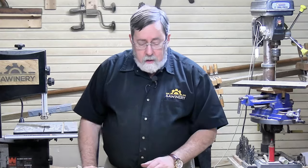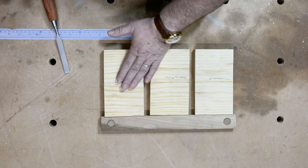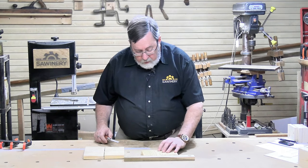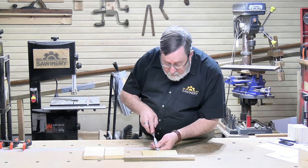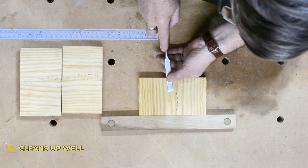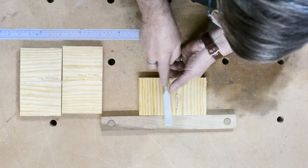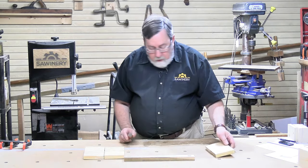The other thing is how easily do they clean up? Looking at the Titebond, it's going to be hard to clean up because it's so far out of alignment, but let's give it a shot anyway. This has been about 24 hours since I glued these. It's cleaning up pretty well. The glue still feels a bit on the rubbery side — it would probably clean up a little better if it were harder and more brittle. But I am able to clean it up, and of course I'd have to sand or plane this to level it out.